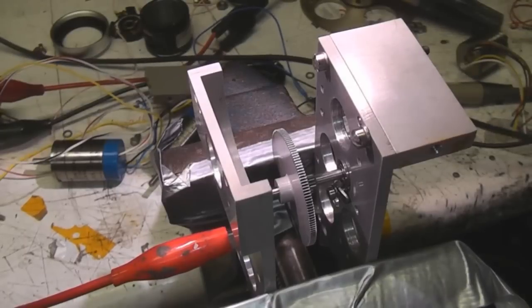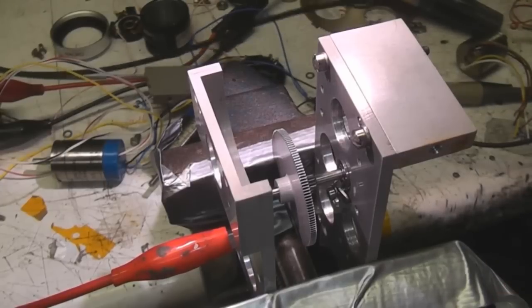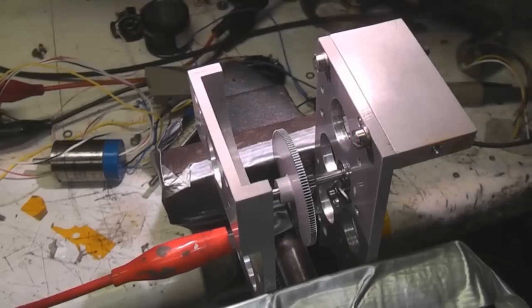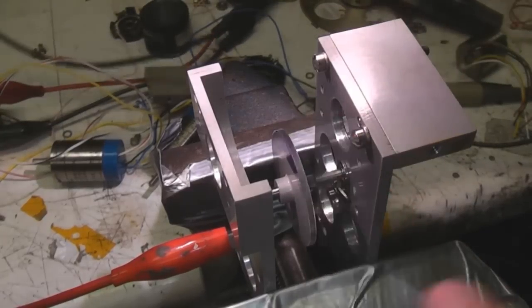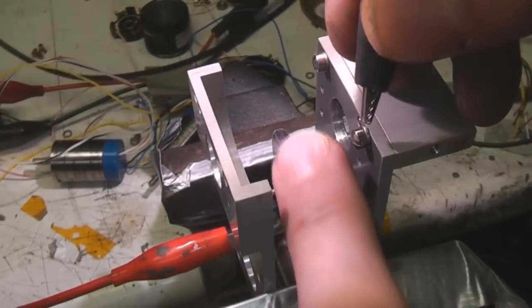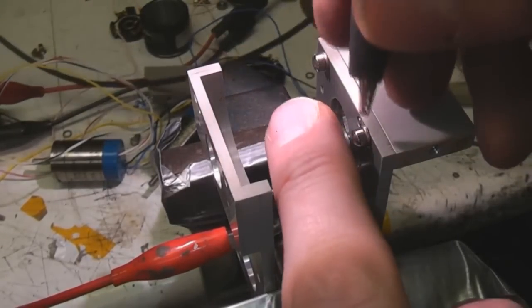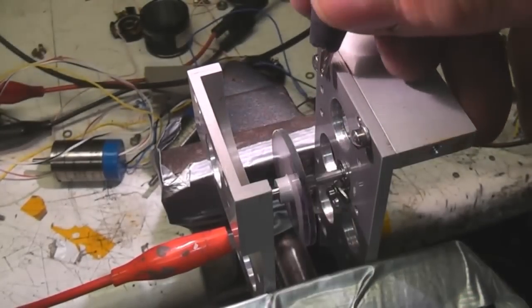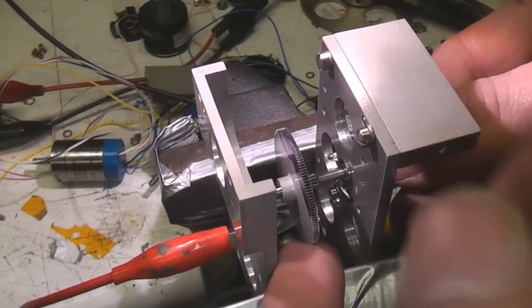Generally what happens is they speed up, and then as the bearings expand and start to seize up, they slow down, grind to a halt, and if you're lucky produce lots of smoke from the oil. But let's just see what this one does. So I'm going to give it a very slow spin to start it, then connect the supply. I'm just going to get them moving slightly, and basically they'll carry on moving in whichever direction you start them. So I'm just going to give it a little spin to start it. Good. Spin it the other way.